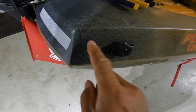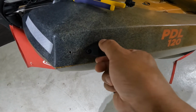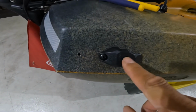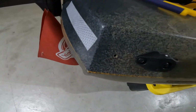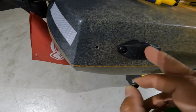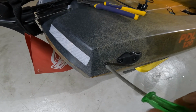Okay, because this pulley is now installed. I'm gonna probably tighten it a little bit, but I don't wanna tighten it too much since we're dealing with plastic. Okay, now that these 2 screws are in the backing plate, it's tightened, we have this third hole. And what the instructions say is you're supposed to use a shorter screw that it comes with, not the same one as this. This is the number 10. This will go into the final hole in the backing plate.